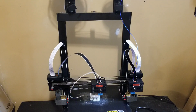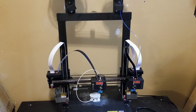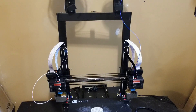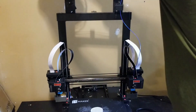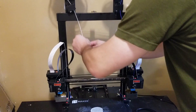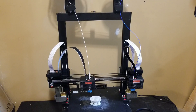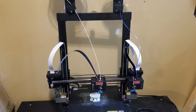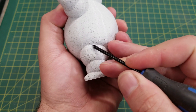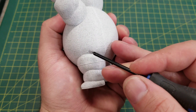Next I tried the filament runout sensor. This printer has runout sensors for both filament feeds. I cut the filament mid-print, let it run out — it gives a warning, beeps continuously until you reinsert the filament, then you hit resume and it carries on from where it left off. Again there's a slight defect in the print as it's not fully primed when it resumes, but it's better than losing a multi-hour print.